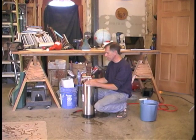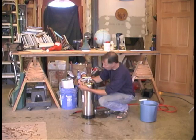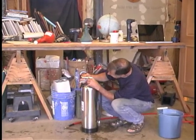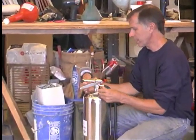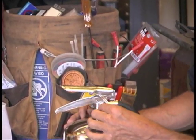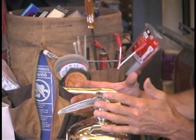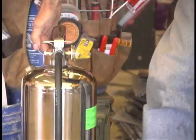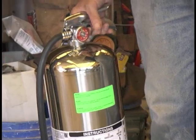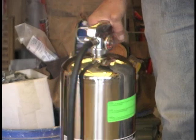It looks like we don't have any leaks anywhere. Then take this key and lift the handle enough — you'll see there's a hole on the handle and you just run that through there. With this wire setup, it seems better if you do it on the valve stem side, because the way the plastic is, it kind of keeps it going in that direction. Once that's in there, you can lift the whole unit and won't be able to accidentally fire the extinguisher off.